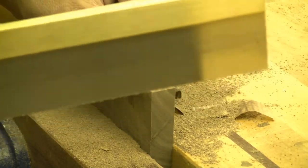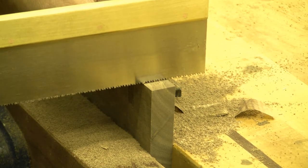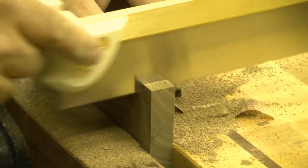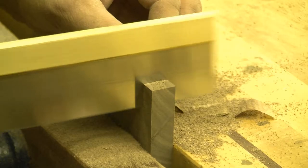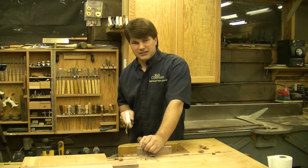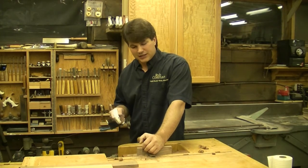Pinch the wood, press laterally against it, just the weight of the saw for downward pressure, pull back slightly and go forward. As soon as you get started, use the full length of the blade — that's going to give you maximum life out of the sharpening. When you're done you should have a kerf or a surface that you could easily join to. Now how do we get to that point so that every saw cut comes out like that?